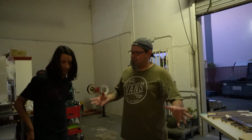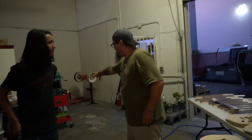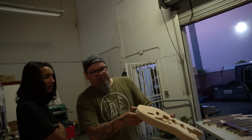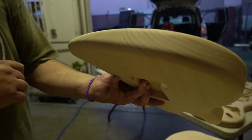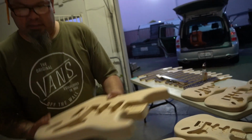Sometimes they'll take two separate pieces of wood and make it look good because they cut something else out that was a big giant knot, and then they put that one up with this one, but it's not the closest relation. So we want to see the closest relation. See how that wide grain doesn't match this narrow grain? That's two different pieces of wood, or there was something in the middle that had to get cut out, like a knot.